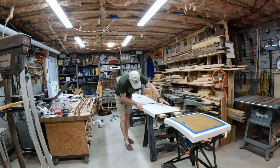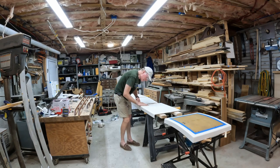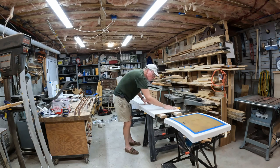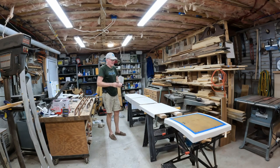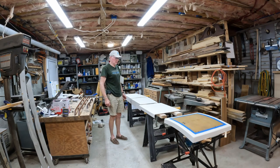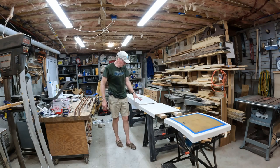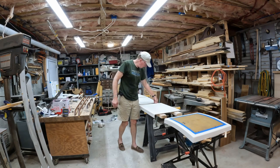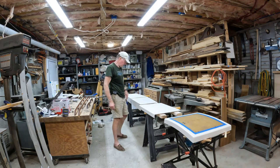One of my biggest concerns right now is that I may start wet sanding some of this as my sweat drips onto it as I'm sanding. And then when I'm ready to put on the final coat, I think what I've decided to do, since these cockpit hatches, I want them all to be the same color as the cabin house, the cockpit, everything else. So I'm going to get some non-skid, and when I put the final finish coat on, spread non-skid, maybe mask around the perimeter, mask the front edge, and just have this nice defined non-skid surface.